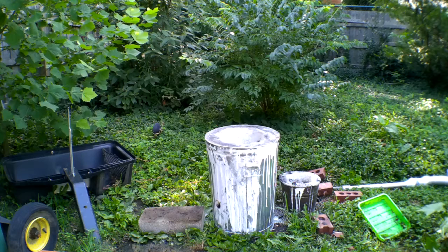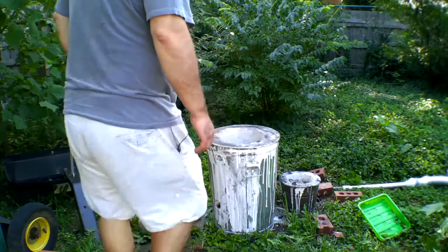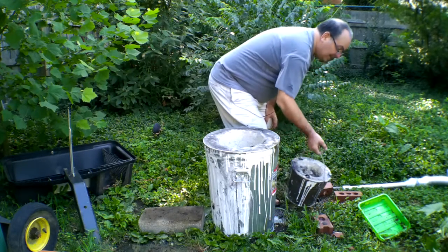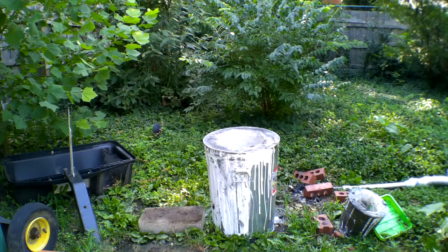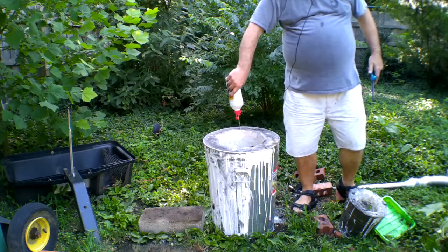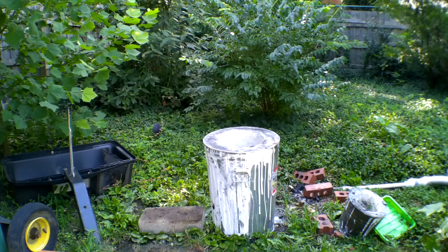While it's smoldering, I'll go ahead and put the crucibles in for 30 minutes or so just to get them warmed up, and then I'll give them 30 minutes with air. And once they've had 30 minutes with air, I'll just let the thing burn down. So that ought to take an hour, hour and a half for the fire to go out, at which point I can just wait for them to cool to the touch, pull them out, and see what I've got.